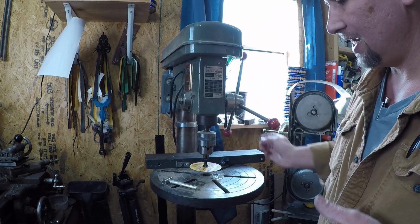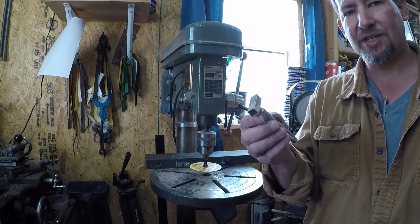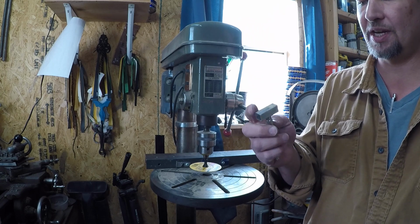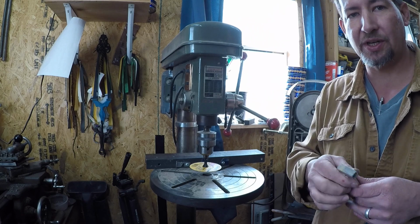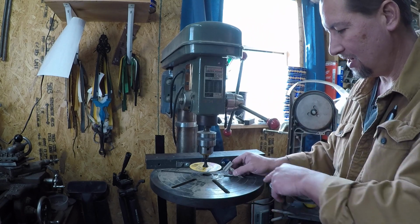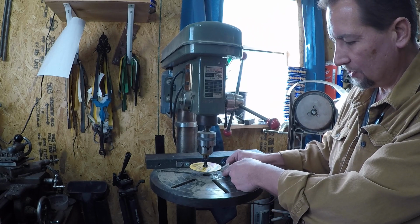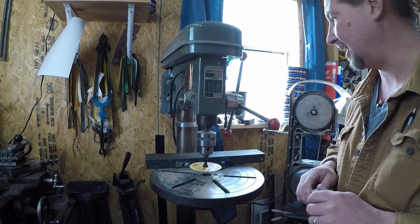And then the other day when I was using this on that other pocket knife, I thought, what about a dressing wheel or a dresser for a grinding wheel? This is industrial diamonds for dressing silicon carbide wheels on a regular hard wheel grinder. And come to find out, you have to put this in a little slot here, and then you hold it at whatever angle, and boy, it dresses that thing down and makes it look nice.